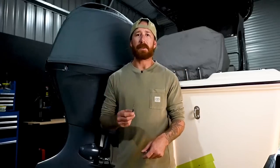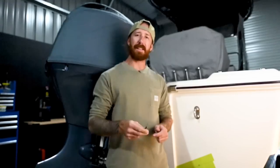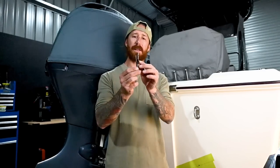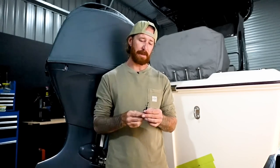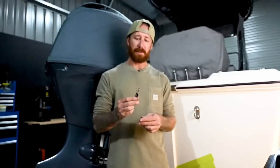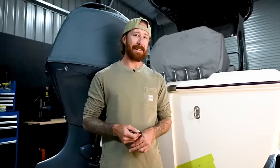The tab will be fitted very shortly. We've got all our holes drilled. A little lesson for anyone dealing with gel coat and putting big screws into it: just use a countersink bit and lightly take the edge around your gel coat where the hole is away — it'll stop the screw biting in and cracking and blowing out your gel coat. It'll also help the Sikaflex or marine sealant to bind to the gel coat a bit better because it's got a solid surface to stick to.